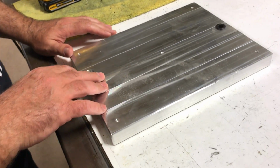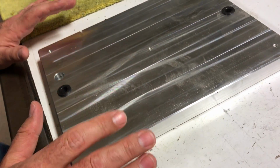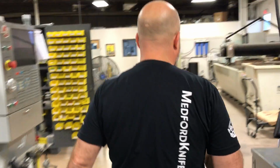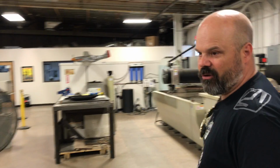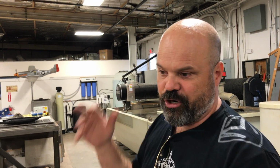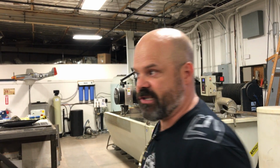This is one of the plates, you guys. These are the precision locating pins, and then we put these little hardened ground feet, and we grind it all together at temperature. What's interesting about this is it'll hold 0.2 of a thousandths repeatedly. So we get this level of repetition where we can pull a part off, pull the plate off, put a new plate on, make sure the tool crib and the machine's right, and we can be off and running in an hour on a new knife instead of 3 days of tweaking and adjusting. It's pretty cool.